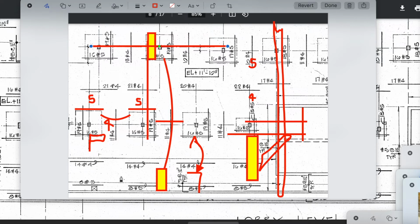So now if you run your floor this direction, it skips this, it misses it. Quite a few, a large significant section misses it from the outside edge of here to the outside edge of this one. And so that's a section there that's going to behave differently than if it's over here. Because now, as it comes from this area, remember this is my bias, this critical cantilever, so I'm stopping there. You can push it back here if you don't like my bias. But it comes across this head area, this critical shear zone.